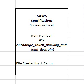3. If the restraint limits do not fall on a joint, restraint shall be moved to the next further joint. 4. Cutting of pipe to install joint restraints is not permitted. 5. Special ties and anchor fittings may be utilized in conjunction with blocking when shown in the contract documents or as directed by engineer or inspector. 6. All thrust blocking shall be a minimum of 3,000 psi concrete placed between solid ground and the fitting except as otherwise shown in the contract documents.